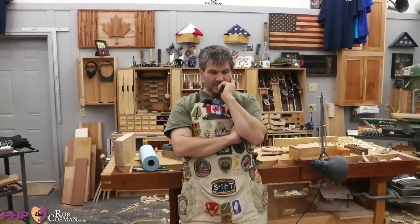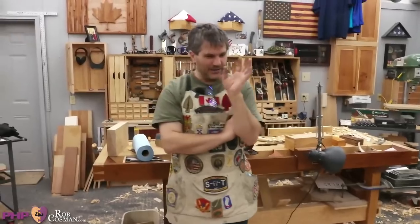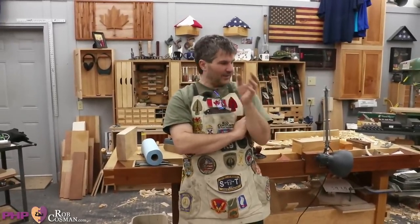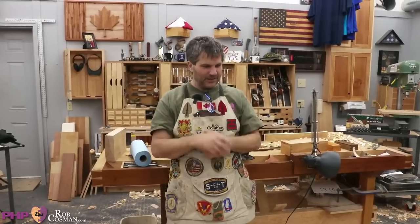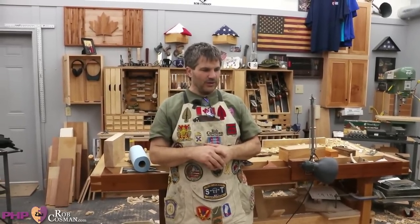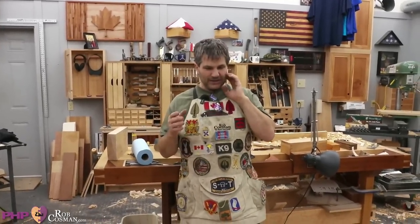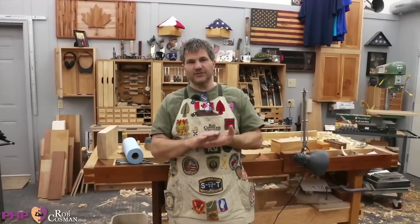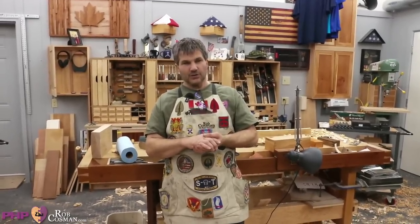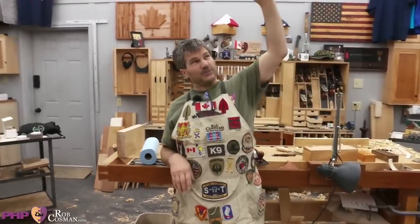So if I'm working here at the bench, building something and I'm in that zone, I really don't want to be stopped. I'm doing something and I'm full steam ahead. So your plane blade, this is going to be a long answer, but bear with me. Your plane blade has to be made so that it's hard enough to hold an edge, soft enough to be sharpened. So if you were to graph that, when you get your blade perfectly sharp, it's way up here.